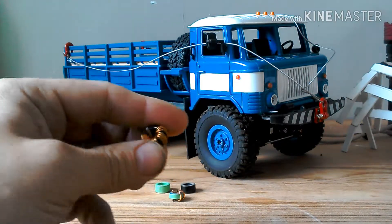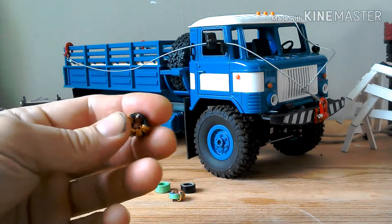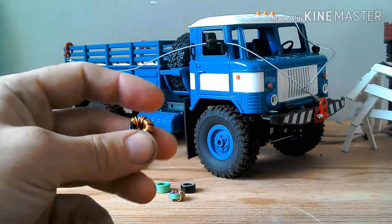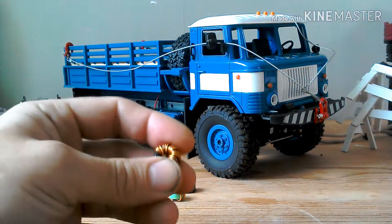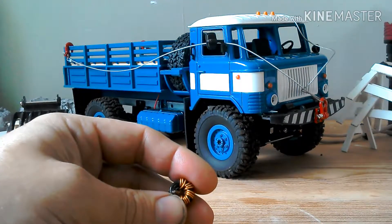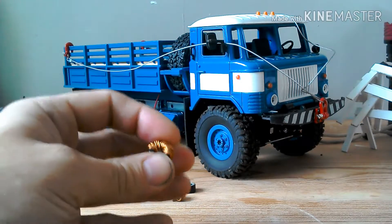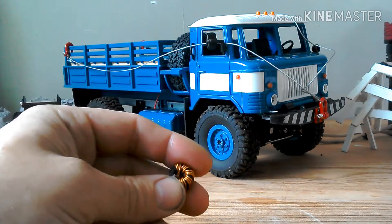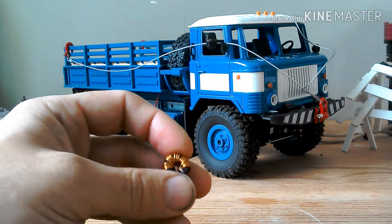These things can be found almost anywhere - you can even buy them, they're fairly cheap. If you've got an old computer lead, you may have found the lump at the end near the plug - that's usually a ferrite choke and you could probably use something like that. If you bind the speaker wires around it several times, in my case it's completely cured the noise. It doesn't matter how close I put the speaker wires to the power leads or the motor leads, it stops the interference dead.